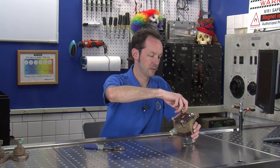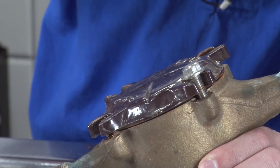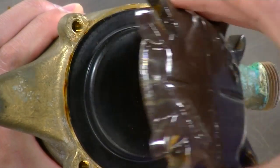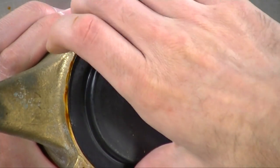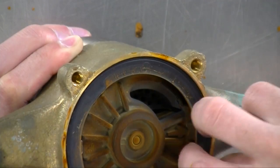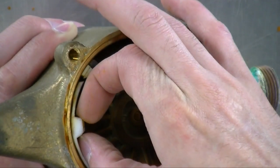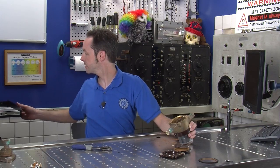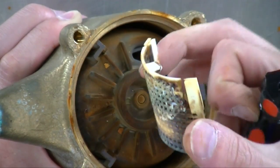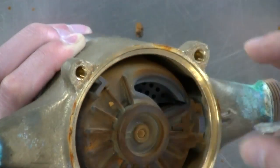We'll start digging in through the bottom because there's four big bolts down there. Under the cover, we find a diaphragm that maintains its watertight seal. Under the diaphragm, we can see there's rust in here. And we've got an O-ring. That looks like an inlet screen to protect it from gunge — we'll pop that out. So that's our input screen. Every bit of water in this person's house flowed through this. And then they drank it. It's a nice thought, isn't it?